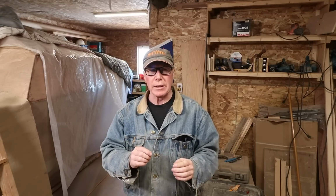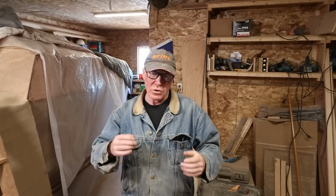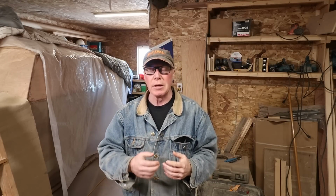So one option, and this is where you see most people going these days, is aluminum tube. You try to get an aluminum tube that's light enough, but at the same time stiff enough that you can compress it and it won't bend. This in particular you need for a cambered sail. But for my flat sail, wood is still a very good option.